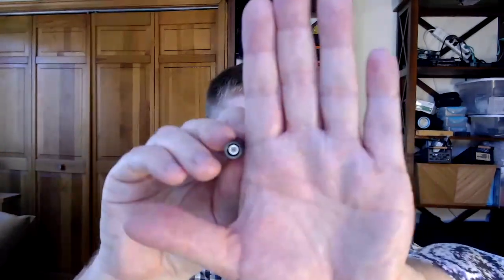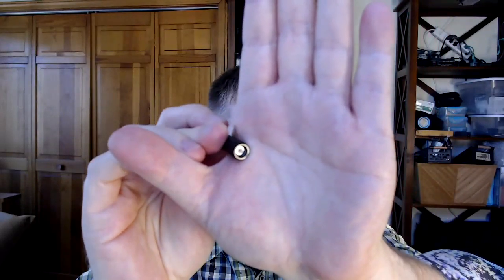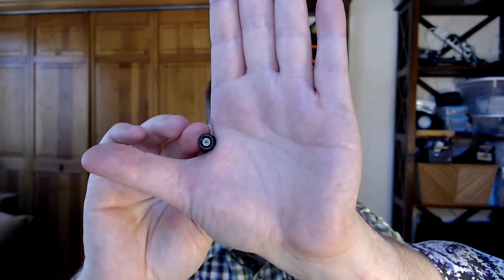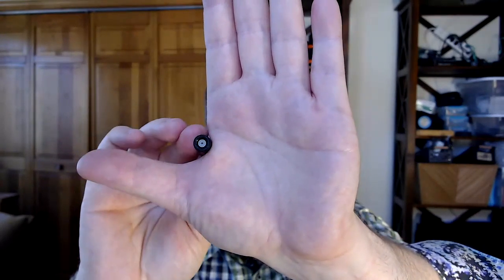This is called an RP-SMA, a reverse polarity SMA. You see this is the antenna, the antenna base, and if it'll focus. Come on, focus. There you go. The connector on the antenna does not have a pin. Most Wi-Fi kit, most of your Wi-Fi routers and such, have antennas, and most of them are RP-SMA.